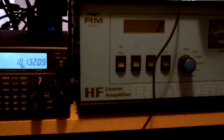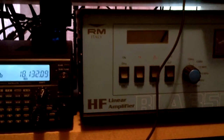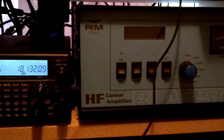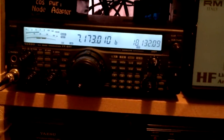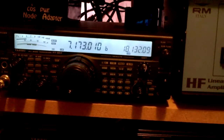With your ATU, I think you say you've only got a 300-watt one — you probably need something a little bit more than that, especially if you're going to be running with the 847. On the tune-up with the 847, I've had anything up to about 450 to 500 watts.